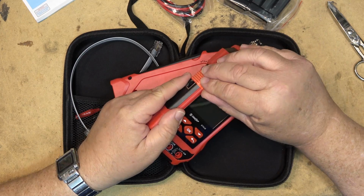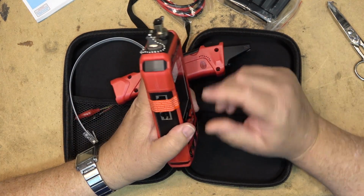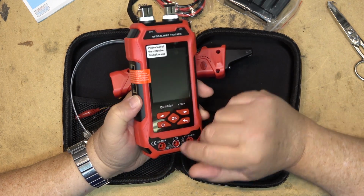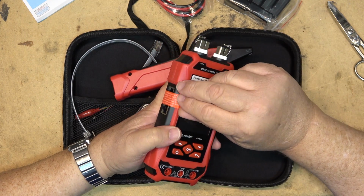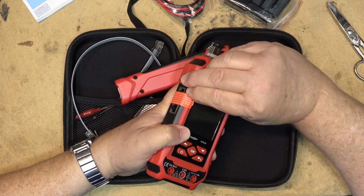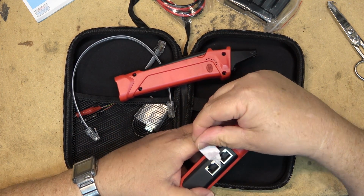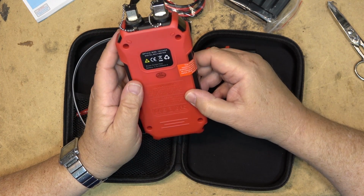Probably the other product. So, yeah, this is for measuring the length of the cable, and you can't have anything connected on the other end because this is going to send a high voltage down there for measurement. So there's a warning sticker there to warn you before you can even utilize that feature, that you have to remove or disconnect anything on the other end.